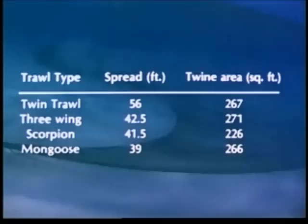An important factor in trawl performance is the relationship between the size of the door and the size of the net. The doors provide the spreading force, which opens the net to its fishing shape. If the doors are too large, they overspread the net and burn more fuel. If the doors are too small, the net will not be spread to its most efficient configuration. There are differences in opinion among fishermen as to the best door size for any given net, and the best size may be different for different vessels, types of bottom, and the way trawls are rigged.